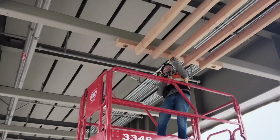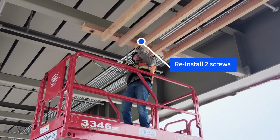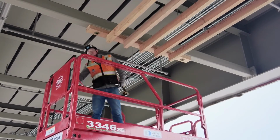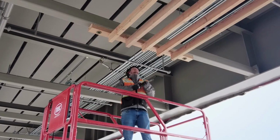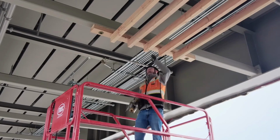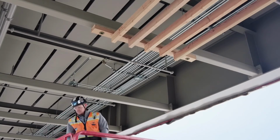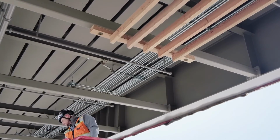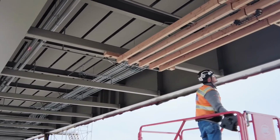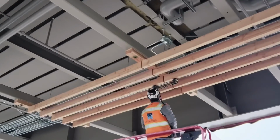Is that the final design with the two screws, and the ones in the back were a preliminary design? Looks like there's one screw on this back too. So there's an alternate fastener discussion going on because with timber screws, you can screw them in and out, but there's a limited number of times you can do that without stripping the fiber out of it. There are many different variables to that, so we don't know how many times you can put it in and out. If there are areas that we know are going to be accessed more frequently, there's a different fastener there. The one that's in there basically has a fixed embed in the beam above, and it's basically just a bolt. It's a machine thread. You can just back it out. And in that case, it's just a single one.